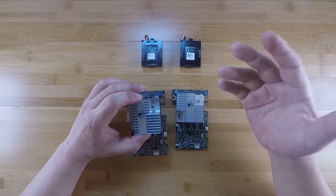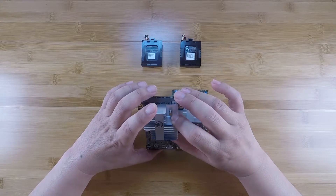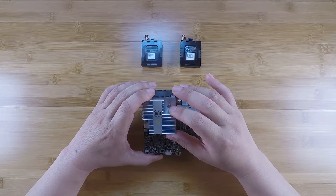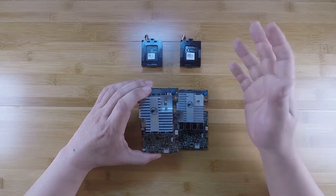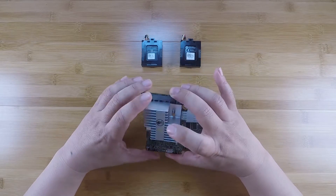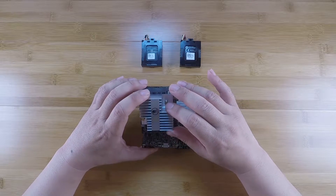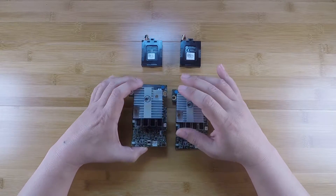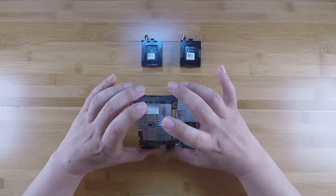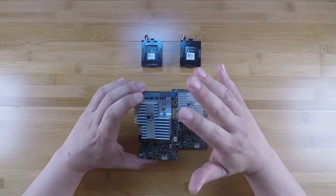Some things I want to share: the SBR format on these cards is totally different. The tool I've shown you guys in the past called SBR Tools — a Python script that parses a text file and generates a binary SBR — that's not going to help you here. I basically had to go in with a hex editor and figure out what the SBR had to be for these things. These cards have a different SBR format, so that's one challenge.